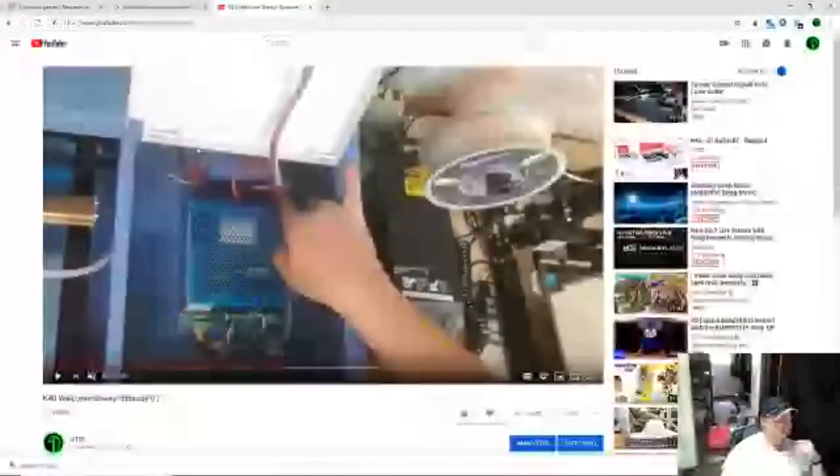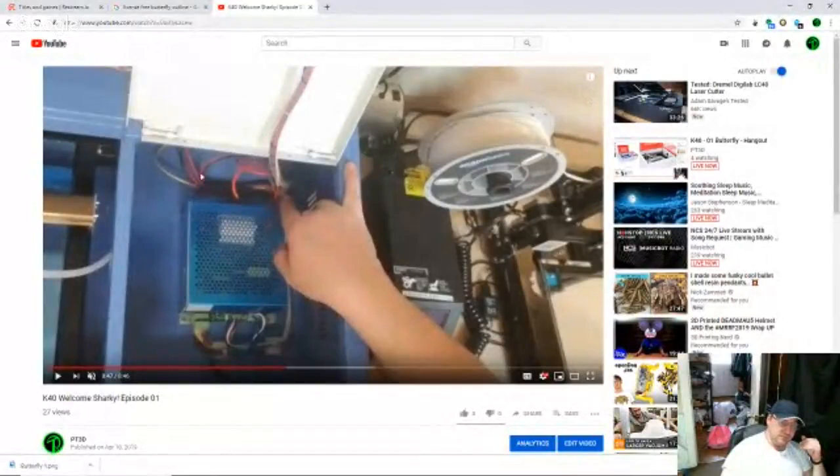So, yes, the other thing, there's a small thing you could do here, which is the ground strap. You can take a grinder and burr off a little bit of that powder coating to get a better seal, a better connection to your ground. I have a 3-pin system, and the building I have is a 3-pin system, so that means I do have a direct ground or earth ground on the outside of the building.